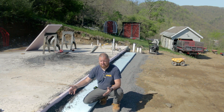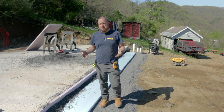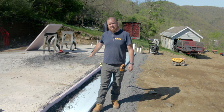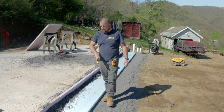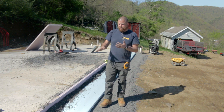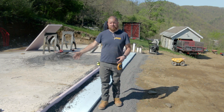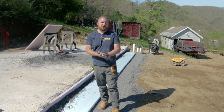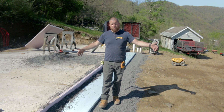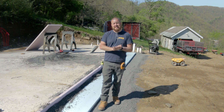This isn't necessary, it's just added protection for your monolithic slab. It's really cheap — we used one to two boards for our front side here and then just a couple strips up on the edge to protect it from any cold air coming in contact with our cement and working towards the inside of our slab. There are a lot of benefits to this. It's super cheap insurance. It's going to help with our heating costs for our slab and just protect everything — we are going to heat our slab, we added radiant floor heat in here. You can go longer and go with thicker insulation to give you more protection.